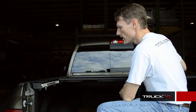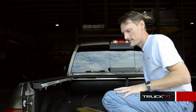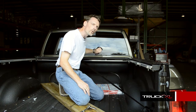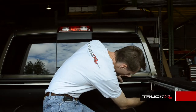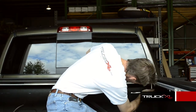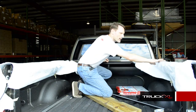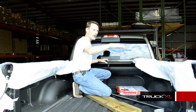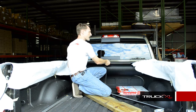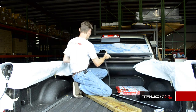My next step is to open the cover all the way up against the stopper bar so that I can remove it. I've just tied off the strap so that whenever I release the stopper bar, the tonneau cover doesn't just roll into the canister. I've also covered up the rails because we're going to draw the cover out on top of your bed caps. We're going to release the cover, let it roll into the canister, and then pull it out to rest on top of your bed caps.